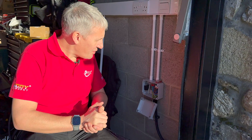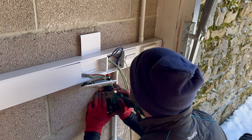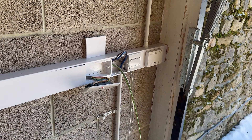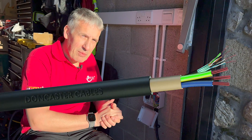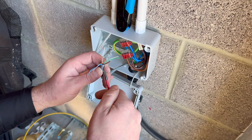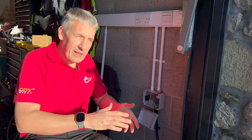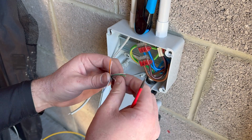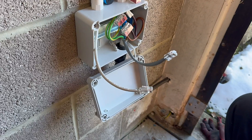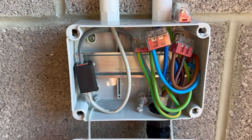It's actually quite warm now that the sun's catching — I've gone down to a t-shirt while Rick's still got that jacket on. At the junction box, we've converted from where we used to make the connection to the earth rod — instead we've brought in another CPC to connect to the TN-CS earthing system in the property. This is also where we convert from the EV Ultra cable, which is a combined power and data cable, so we have to split off the data and the power. The data often needs to go in a completely different direction from the power. We've cut back a short length of Cat5 within the EV Ultra, terminated an RJ45 connector, and then used a coupler into another Cat5 cable that runs off to the network switch via the dado trunking.